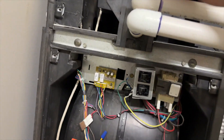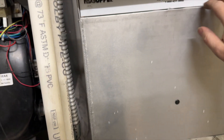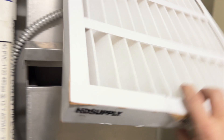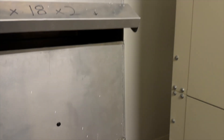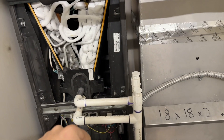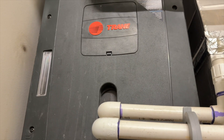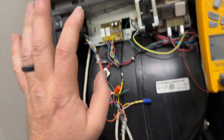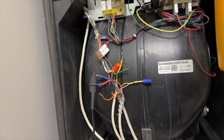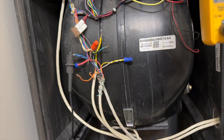I know the fan was running because I could feel air coming out. Let's check this filter. They changed it yesterday, so I don't know what the old one looked like. I hate it when they do that. We need to defrost this bad boy. It's a heat pump, so we can put her in heat mode — that should melt that coil pretty quickly. She's melting pretty quickly now that I got her in heat. Once it's fully melted, we'll check the refrigerant charge and make sure this thing has a low ambient kit.